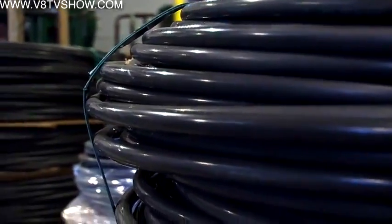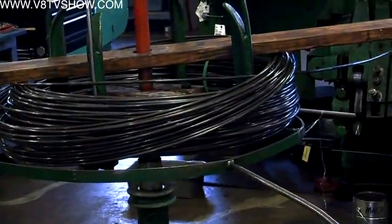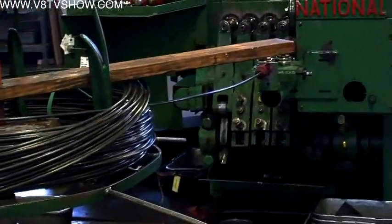So tell me what these machines are called. These are bolt makers — they're cold formers. They take the raw coil, the raw material, they straighten the wire, and then through a series of hits, they shape the head onto the bolt. So in this room, you're actually starting the formation of a bolt.